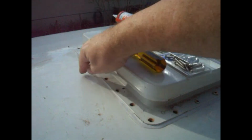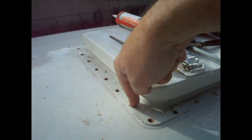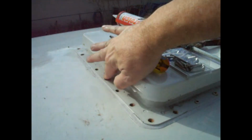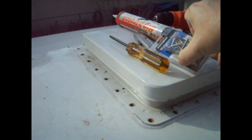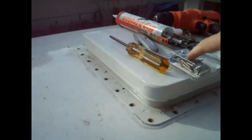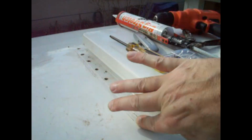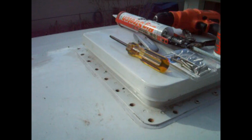What I'm going to do is clean this all off, and then I'm going to drill into the new wood, put some caulk into each of the holes, and then put a new stainless steel screw into them. These are 1¼ inch, which are about the same size as what I took out of there. And then I will caulk around here one last time, or put a drop of caulk here, and then I'm going to finish it off with some flex tape, not sponsored, obviously, with 16 subscribers.